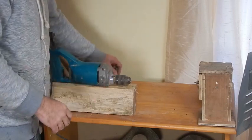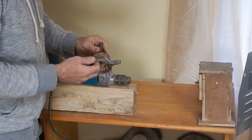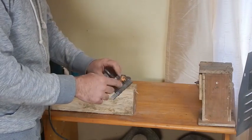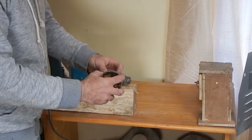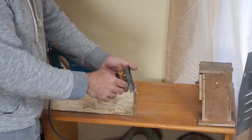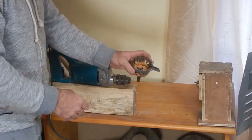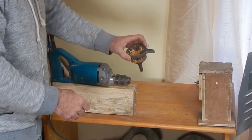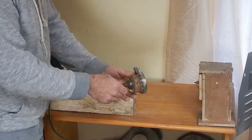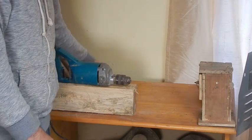And then I had this, now it's very rusty because it's been just thrown in the cold shed at home, and it's got pretty rusty. But yeah, very sketchy. It's an old hole saw with slots cut into it and a pipe clip around it. And I used to use that as the chuck. I'd put it on the piece, have a tenon turned on it. And I used to tighten that right down. And it used to hold really well. And it used to be quite true. Believe it or not, as rough as that looks, it was really, really good for what it was. And it cost me nothing. It was just left over from when I used to be a plumbing and heating engineer. And then the tools that I used were just normal chisels.